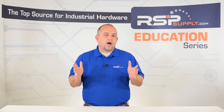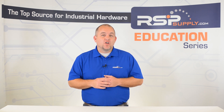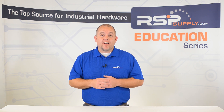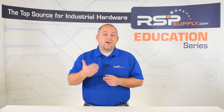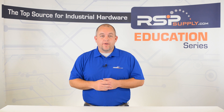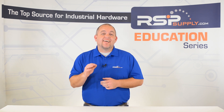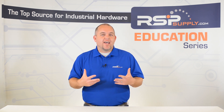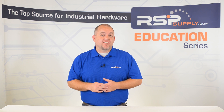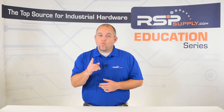In today's video, we are going to be talking about the use of emergency stop devices to cut power to different kinds of machinery like motors, cutters, conveyors, and other common industrial equipment. More specifically, we are going to be referencing the ISO 13850 standard for e-stop function and look at two different e-stop categories that exist to find out about when you might use one or the other and why.